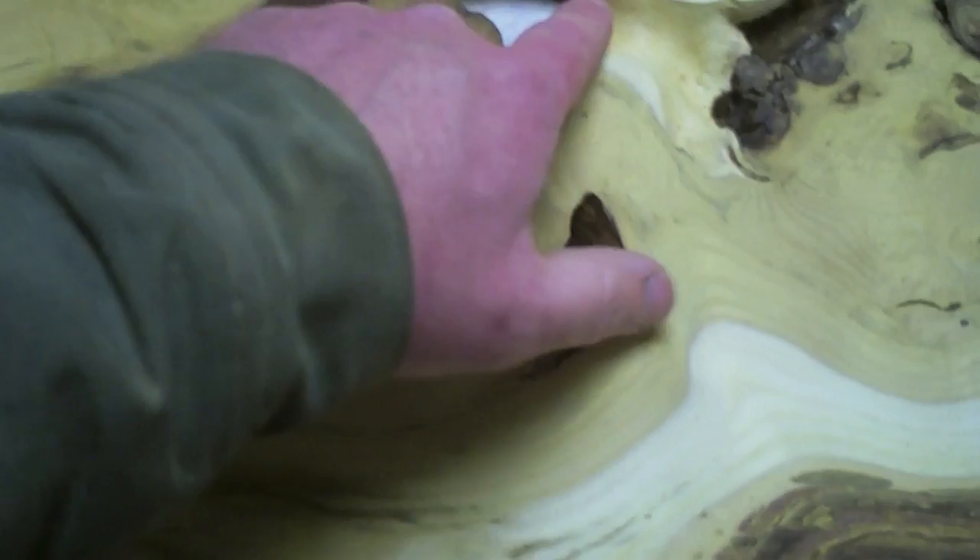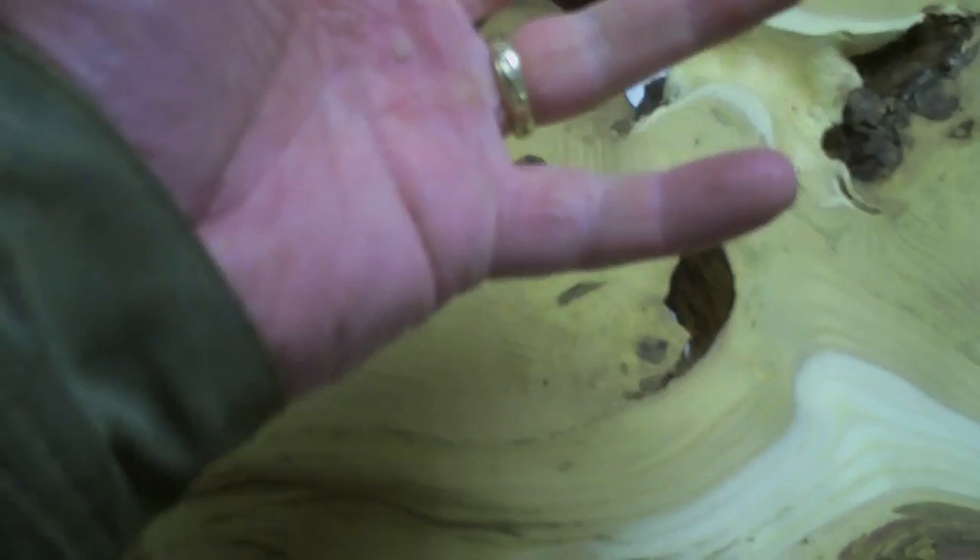We need to finish this wood first. We're getting ready to pour the first coat of epoxy for all of these — what will eventually be blue glass epoxy pools. I've got it sealed off with clear tape back there. I'm about to mix a little bit of epoxy and attempt to paint the inside surfaces to seal them, and seal my tape to the bottom of the board. When I fill it all the way up we don't get leaks, and hopefully about an eighth of an inch of epoxy in the bottom so I have a rigid base.